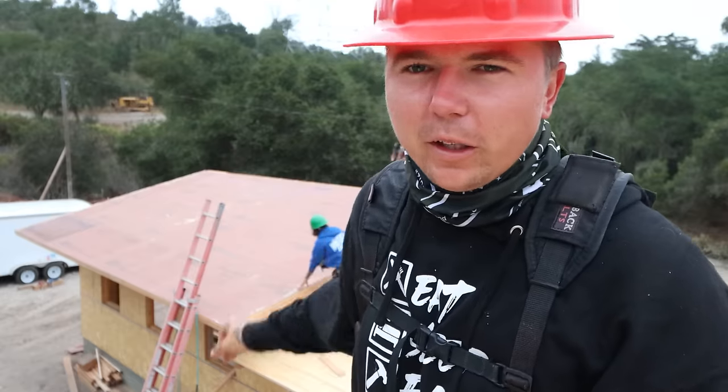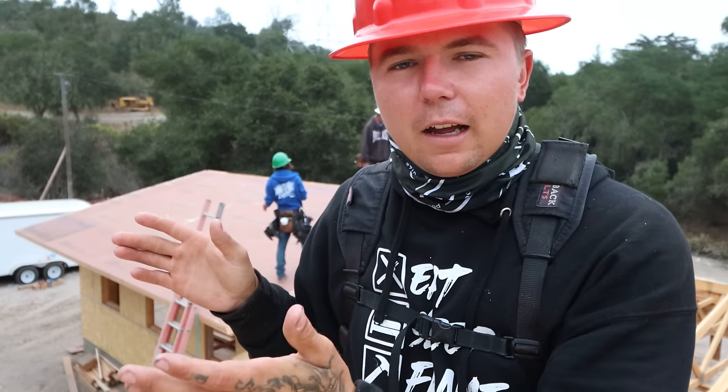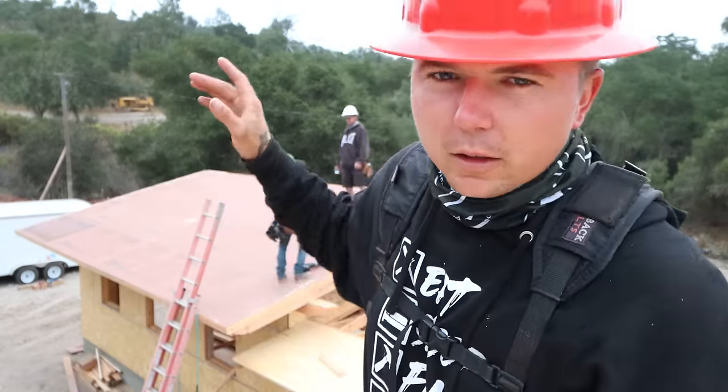Today, though, we're going to be working on sheeting out the rest of the garage. It's only going to take us a couple minutes. We have to cut back the roof sheathing. We have a little 3-inch, 4-inch piece up at the top there, and locally, we have to have 2 feet. You're not allowed to have a small little ripper up top. They're going to cut that back right now, get a 2-footer put in the top, sheet out the other side